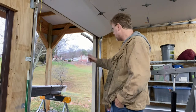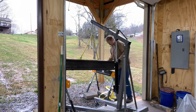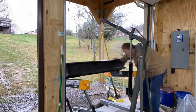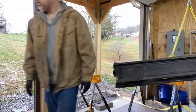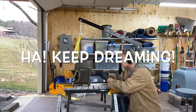Good morning. I'm going to work on getting my lathe bed back inside the garage. It's been somewhat rainy and I'd like to get it out of the moisture. We've got all of the paint taken off, so I'm not so worried about the dust anymore. I'm going to be putting some Bondo on — going to try putting it in multiple thin layers so I don't have so much to sand off. So let's get going on that.